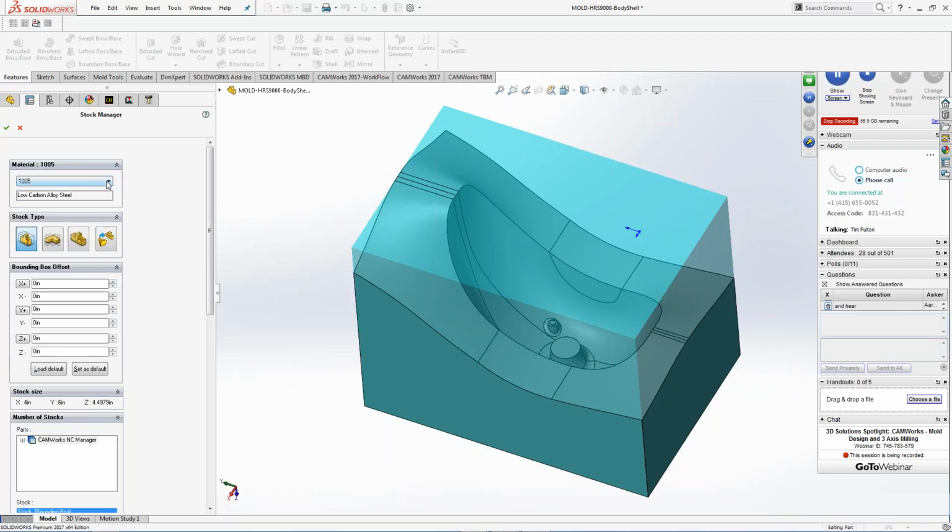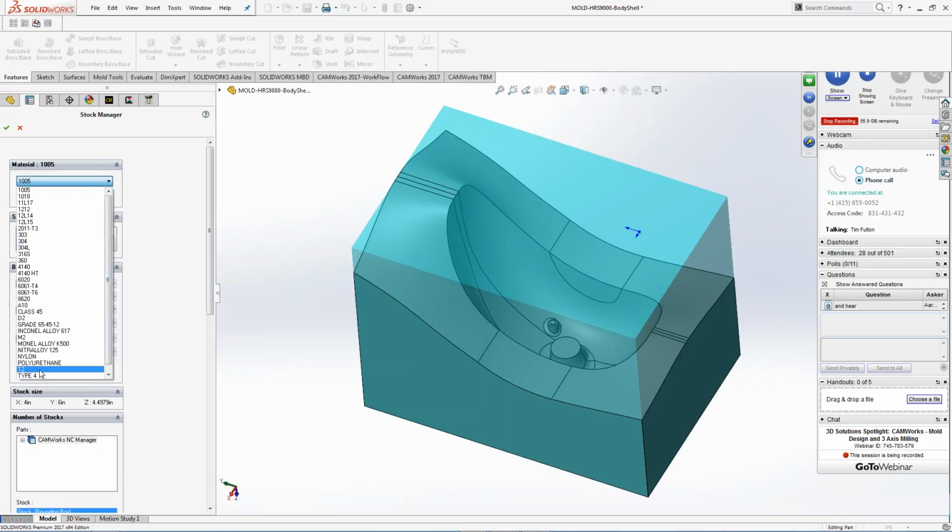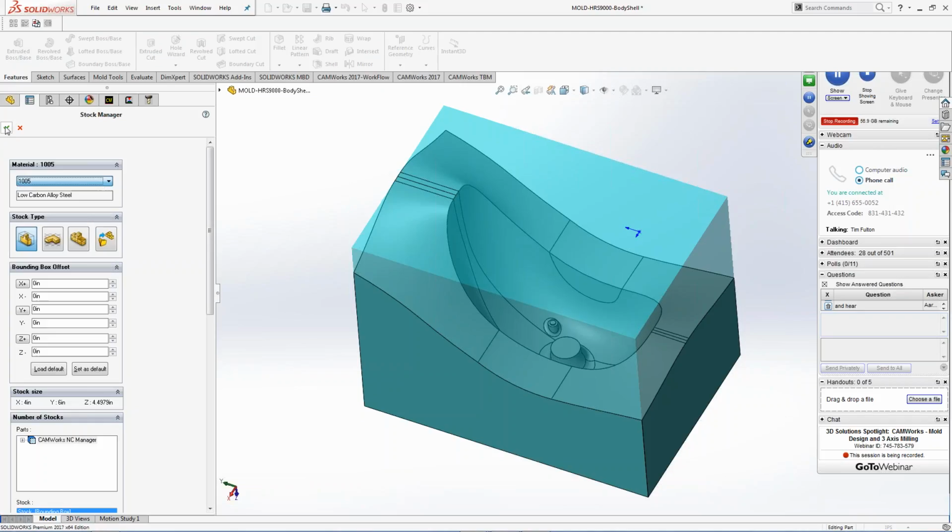For the material, I'm going to go into tooling steel, but you know, T2, A10, it depends how you're going to do it. Maybe you're going to make an aluminum mold first and just see if it actually works. You have those options inside of SolidWorks and CAMWorks. The advantage is once you program the part, say I'm going to make it out of some 1018 steel, do a couple shots, check it out, make sure it all works, and then reproduce it in some A10. The only thing I have to change at that point really is the feed rates, right? Because the part's already programmed inside the one system.